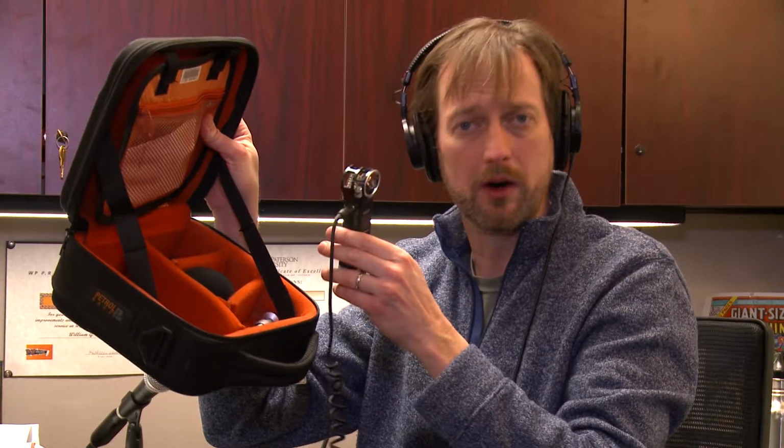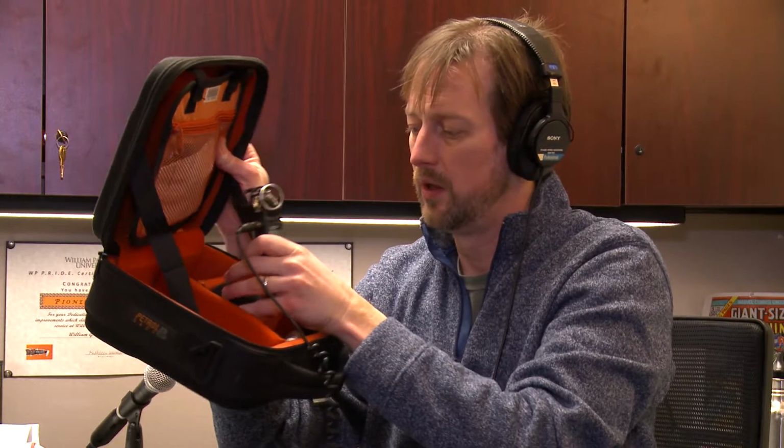The other thing to bear in mind is the kit that comes with your recorder has accessories in it that are very useful to you in improving the quality. The first of which being the windscreen and pop filter. This just snugs over the top. It will help you eliminate pops when you talk in. The wind coming off of your mouth hitting the diaphragm of the microphone puts it into overdrive, and it causes an unnatural sound. So if you're going to be conducting interviews this style, make sure you use the pop filter. This is also helpful in reducing wind noise when you're outside.